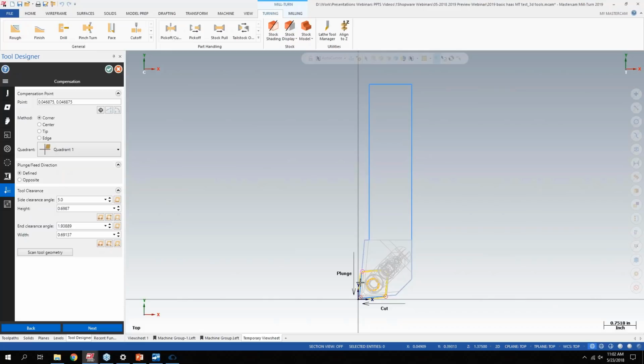We had a question there. Scott asked, are prime turn parameters still the same? Yes. I didn't get into the details there, but we have expanded, because the prime turn being so new, Sandvik's even learning new ways for applications and how it can work. So we've actually added a few more options in the prime turn tool path from feedback of just people using it in the field and how the tool path actually interfaces in Mastercam to what Sandvik recommends.